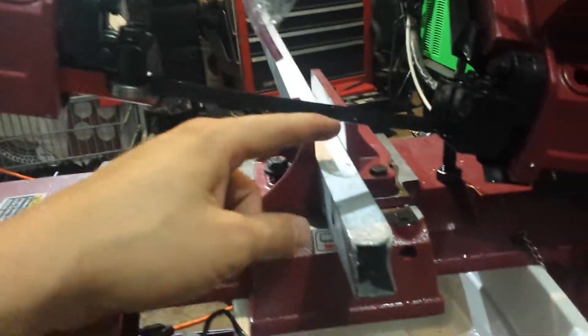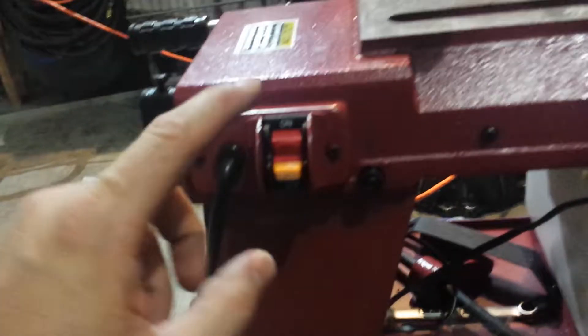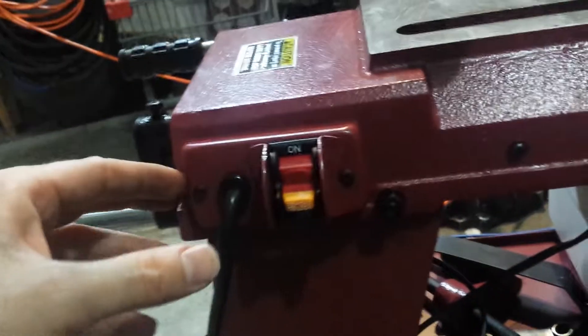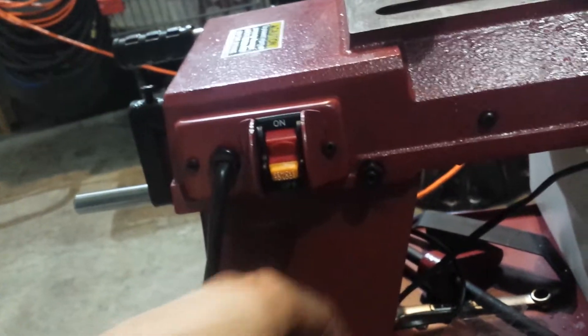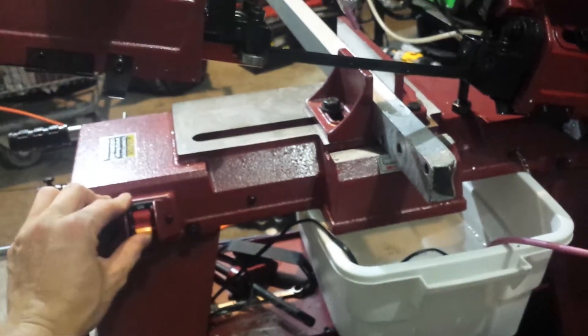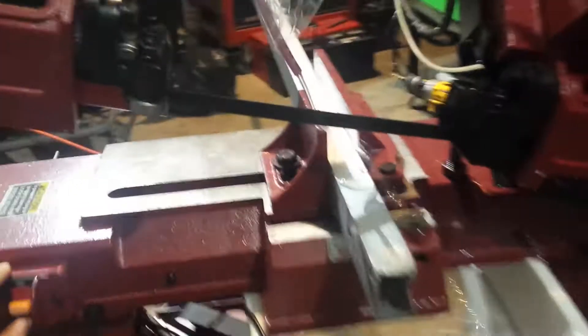I had to put this little stop up to hold this so that the blade is not against what I'm cutting. I wired up this cord right here into this little electrical box — it's just a really simple 4-pin with a ground switch. These screws come undone and this pops out so you can add your wire. I drilled a hole through the little plastic composite protection on the back to get the wire in there. Now any time I turn on my saw, the coolant system will be flowing.